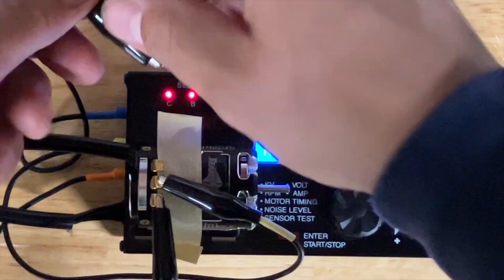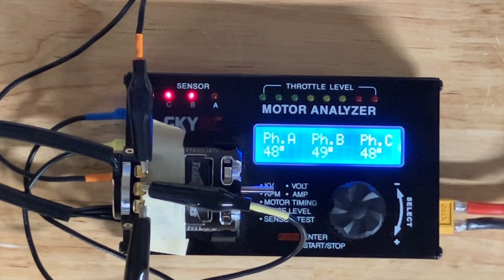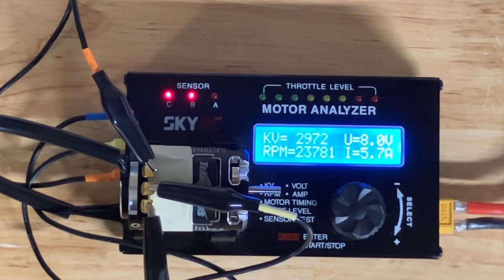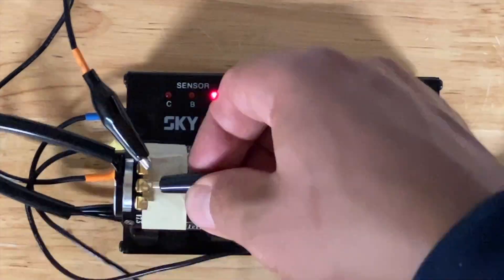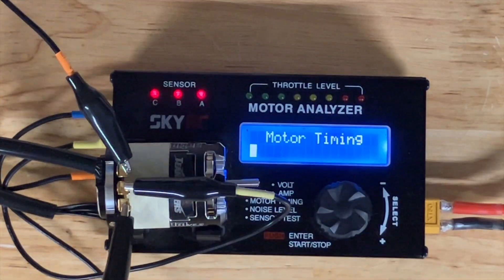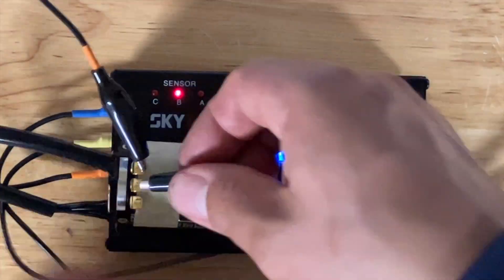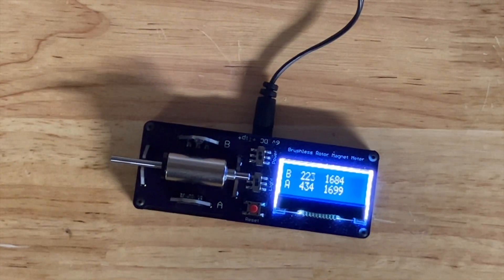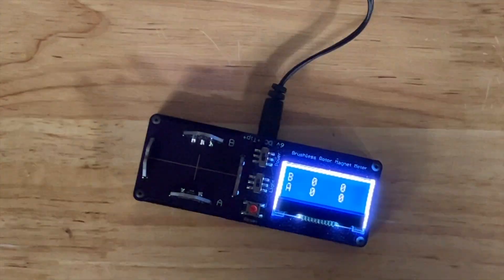The motors are very similarly constructed with very similar weights. Most motors around this spec tend to be just under 150 grams, usually between 146 to 149, regardless of the brand — most of them shoot for that. Now switching over to 13-5: you're obviously going to get a difference in KV simply because it has more turns.